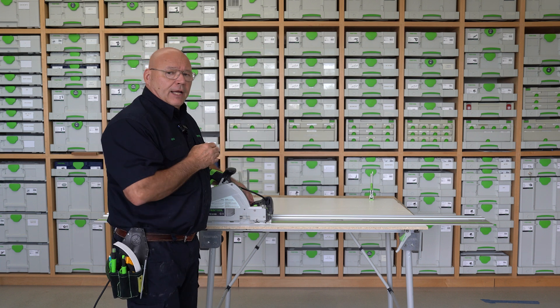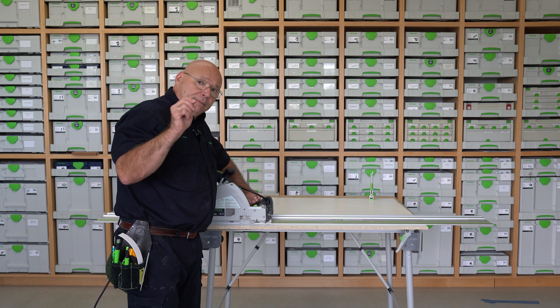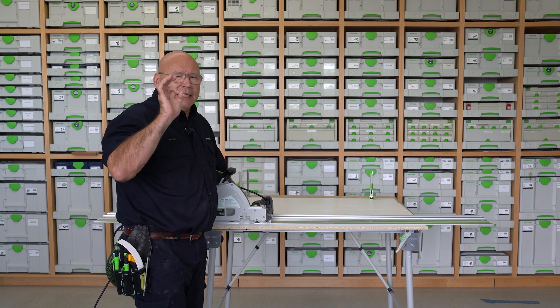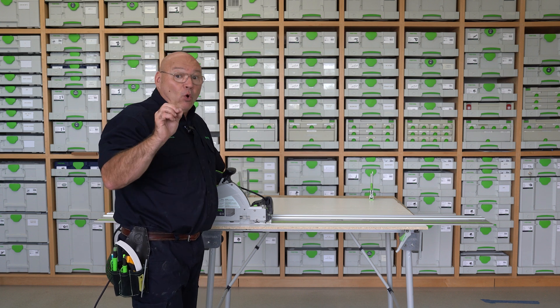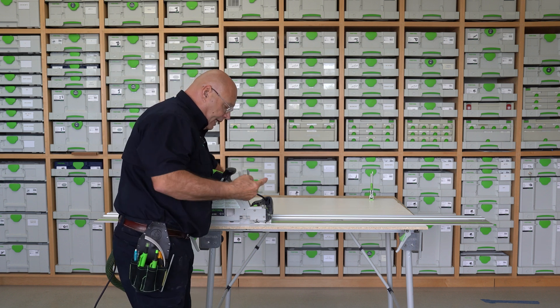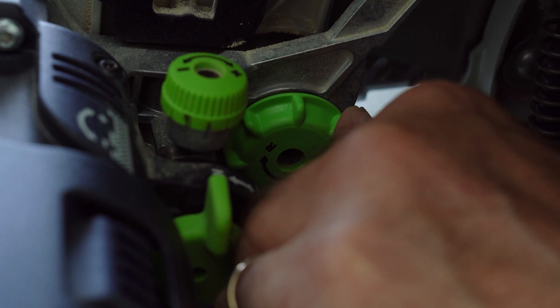The dial back here has 20 clicks on it — and you know the depth setting was very fine at 0.1 millimeter. There are 20 clicks on this side-to-side dial, so you can dial it in precisely; each one of those clicks is 0.025 millimeters. It is a super fine adjustment. So I'm going to adjust that this way a few clicks and let's check the cut again.